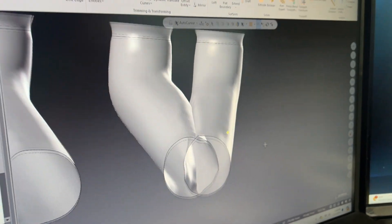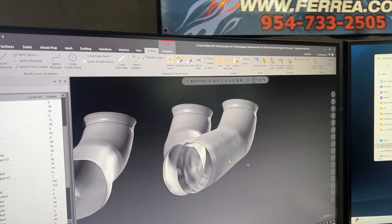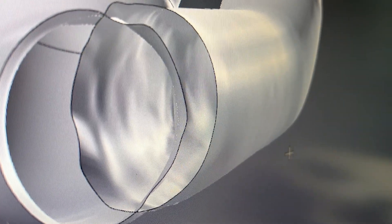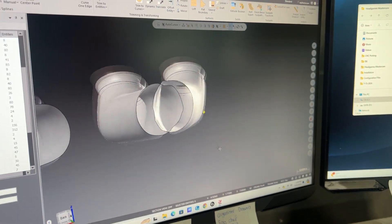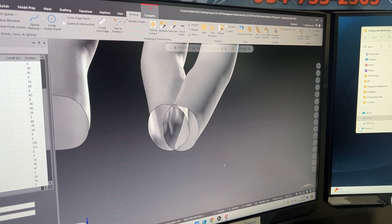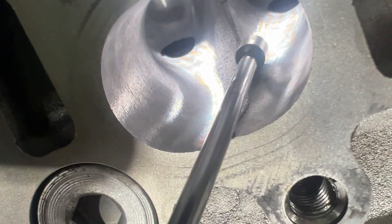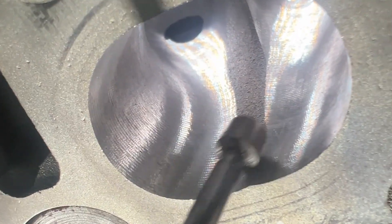So now you've got the exhaust port. You marry them together in Mastercam and you see how it's all bumpy there — all those bumps are the clay. We think we have to just pull it from the divider and we should be good. You can see where it doesn't cut any of this here and it left the port in a weird kind of shape. Now we love fins, but this is not the type of fin we're looking for, and the reason why is because of the clay.